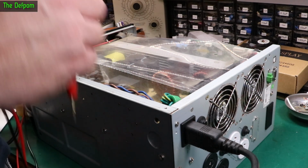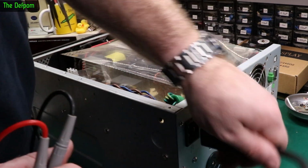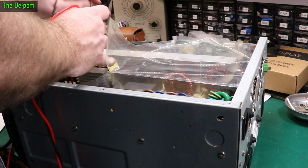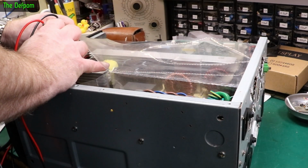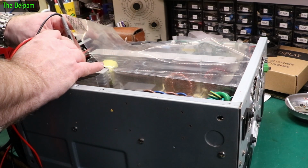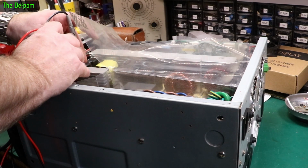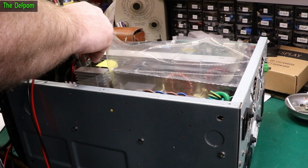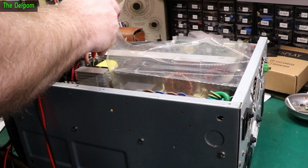Let's just turn this beeper off, it's easier to do. Unplug the power cord, just for the sake of unplugging it. It's obviously powered down, but let's check all these fuses out. Don't forget they've still got battery power present, so it could still be trying to do something. Fuse 2, that's okay. A bit dirty, but okay. We've got the next one, which is fuse 9. Yep, that's alright. It was a bit hard to get into.